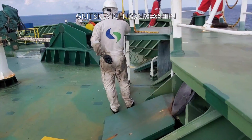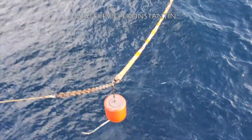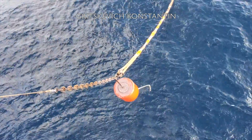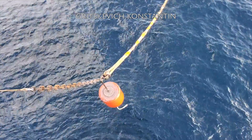The vessel should be brought to a dead stop between 45 and 60 meters from the buoy. At this point the tow chain is lifted into the bow chock and then to the bow chain stopper to be secured under the direction of the pilot.